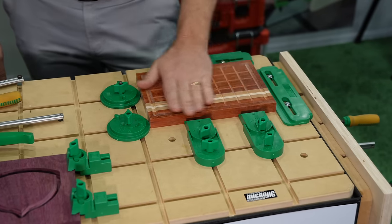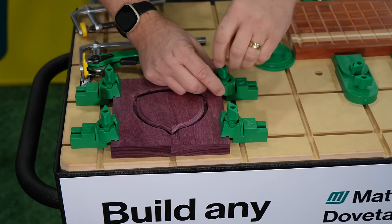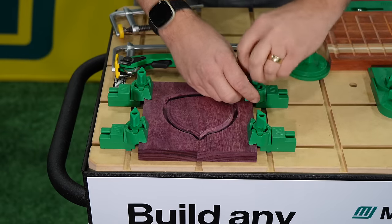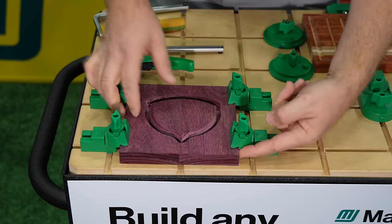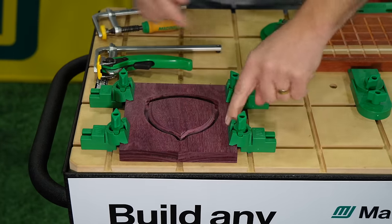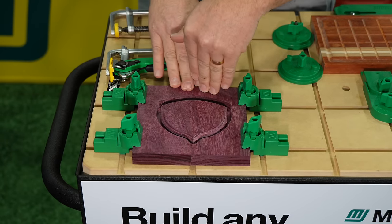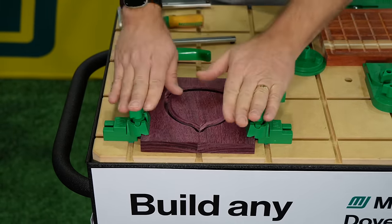If you want to work the whole top of a piece — like a juice groove carved all over — the clamps aren't in the way. They also include four U-pads similar to their clamp EX-pads, but these can hold any piece from very thin with a standoff all the way up to an inch and an eighth thick. Rather than just holding from the top and relying on friction, there's a notch in the edge that prevents side-to-side movement. It intrudes only about a quarter inch into the edge of your part. You can also set a safe Z movement of two inches off the top of your stock so the head moves up and you don't risk hitting the clamps.